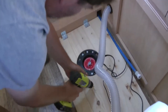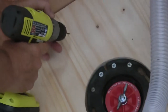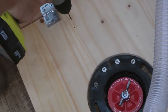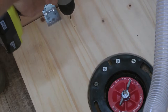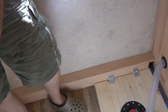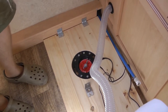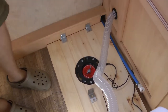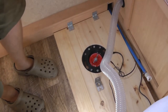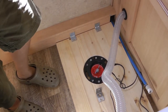You can see where my holes are right here. I always try to be as straight as possible. You can put tape up to here and then go in, but I think it's not that big a deal. When you put these things in, you want to screw the screws in but not too tight, because there may be a little bit of a fitting issue. Put them in semi-tight, and then once you put it in you can check to see if everything is in position. Once it's clicked down to the toilet, then tighten these up and hopefully it all works out.